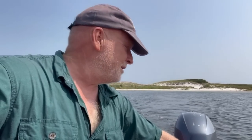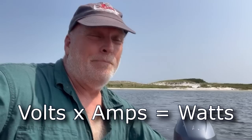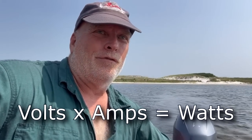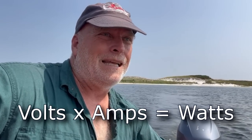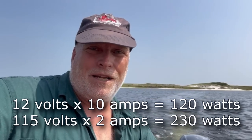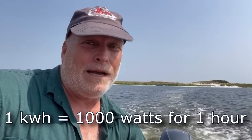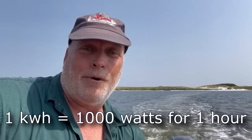Hey, there's really not much to this wattage thing. It's just voltage times amperage. Electricity has two ways of measuring it, and you need both of them. Kind of like pressure and gallons per minute on a water hose. Amperage is like the water flowing through the hose, and voltage is like how much pressure it has behind it. So higher voltage, it can jump bigger gaps. More amperage, it can power bigger machinery. So multiply the two together, you get wattage, and then we can compare everything. It doesn't matter if it's AC or DC, it's wattage. It's voltage times amperage. And then kilowatts, that's 1,000 watts. And kilowatt hours, that's 1,000 watts over 1 hour.